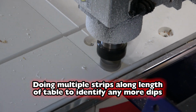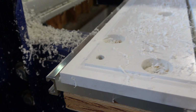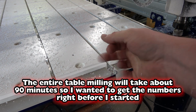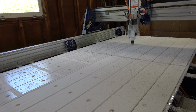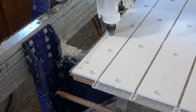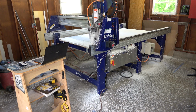Okay, I found the number. It's 0.09 inches or 90 mils. It's kind of extreme for the edges. You can definitely see how much it's taken off, but the middle was definitely the lowest part. Well, I have a number that I know will work. Time to start the messy milling process. At least though, it's Sintra, so it's going to make a less horrible dust than MDF would. All right, it's done. Now we just have to clean up this horrible mess.